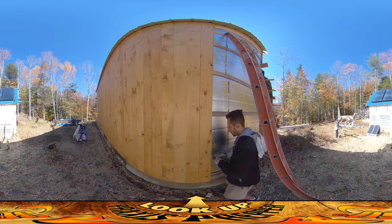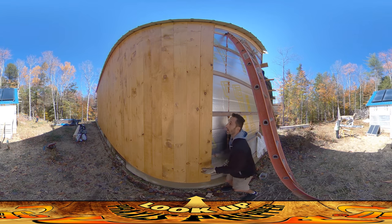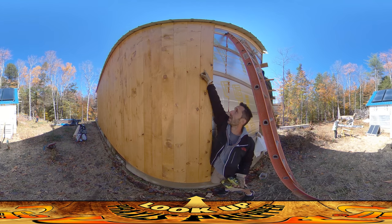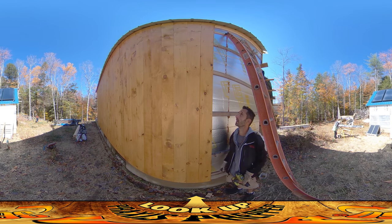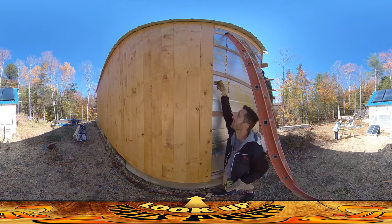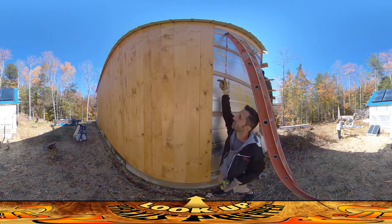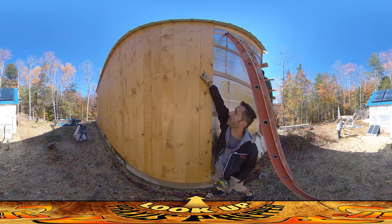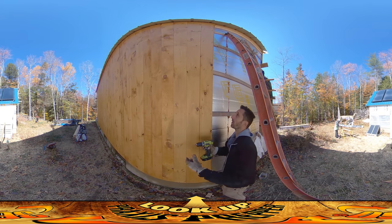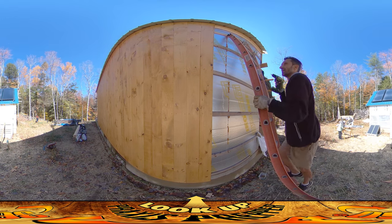I've got all these screws stuck in here — there's one seated at the bottom, one seated up at the top, and all the rest are waiting to go in. You can see the board's kind of floppy and one of them is at an angle, and that's critical for the technique I'm going to use. The idea is when I screw that one in, I'm going to pull the board away a little bit so the screw's insertion point into the strapping is to the left of where the exit point of the screw is in this board, and that's going to pull the board to the left as it goes down — which works by me lifting the board up slightly as I do it.